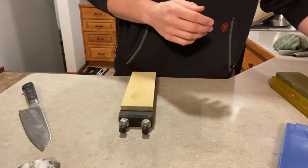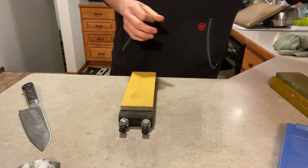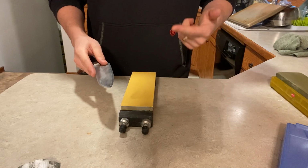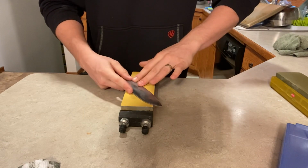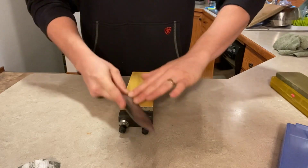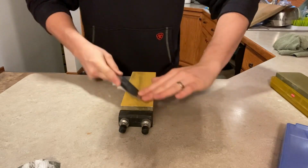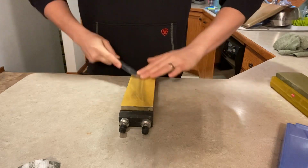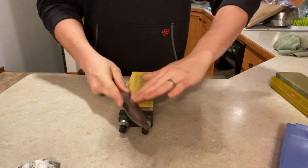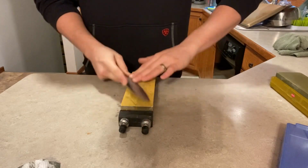But anyways, on to the star of the show here, the 1K. So the question is speed and finish. The reason being is I've got a Nanohone 1K, Chosera 800, I've had a King KDS 1K, and I have a King Neo 800. And all but the King Neo are too slow of cutters for me. The Chosera and the King finish really great though. So if I could get the speed and finish of the King in a stone that is harder and also alumina based instead of silicon carbide based, that would be great. And I'm hoping in this stone to get that.